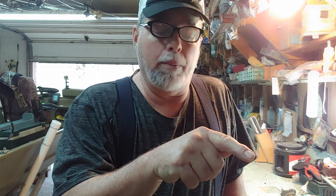Go out into the yard on the side of your house and find your dryer switch or your stove switch — whichever one you're working on — and flip that switch off. My recommendation, where you don't get back-feed: take the little screw out at the bottom of your breaker box, pull your panel off, turn your breaker off for your stove or your dryer, reach in and grab hold of it with your screwdriver, and pop that breaker out. Just take it out and hang it outside the box — then you know for sure you don't have any power on.